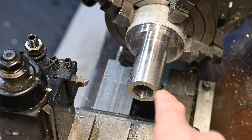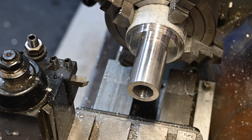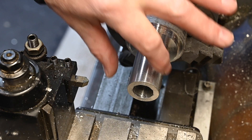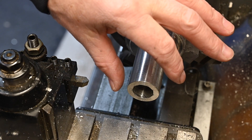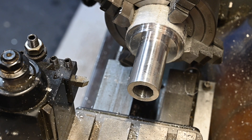That's as far as I can go with the drill — I got it bored out to 20mm. It's quite hot actually. So now I'm going to have to go the rest of the way with the boring bar. I'm going to put the indicator back on because I think it's running out slightly — the big drills have moved it slightly. So I'm going to indicate it back in first.